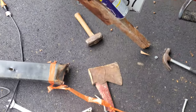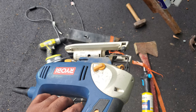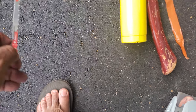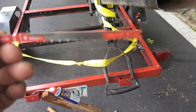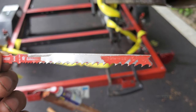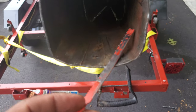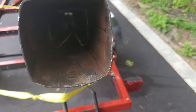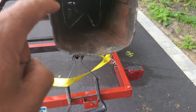Eventually I got a jigsaw with a metal all-purpose blade — I think it's four and a half to five inches, the Diablo series from Home Depot. The problem is the blade can only go in about three inches, so I was able to cut that inner sleeve about three inches deep without cutting the outer sleeve.